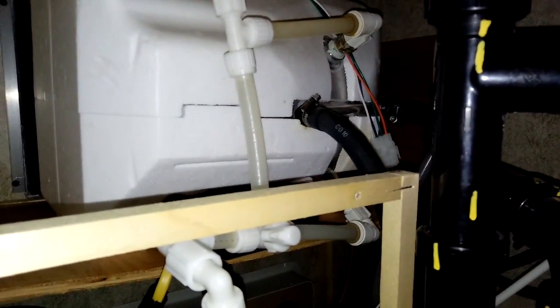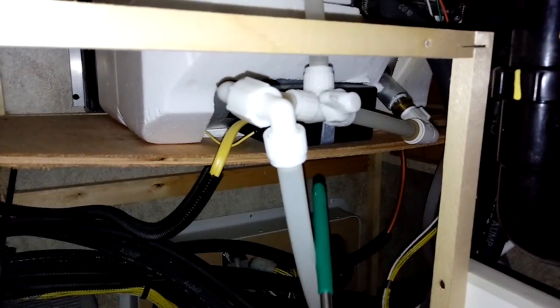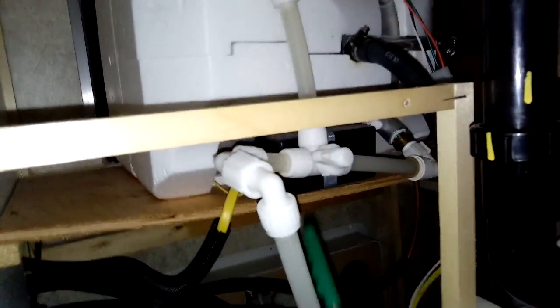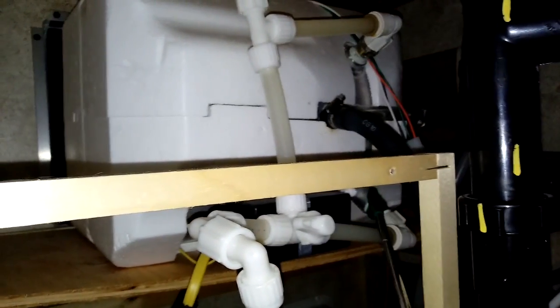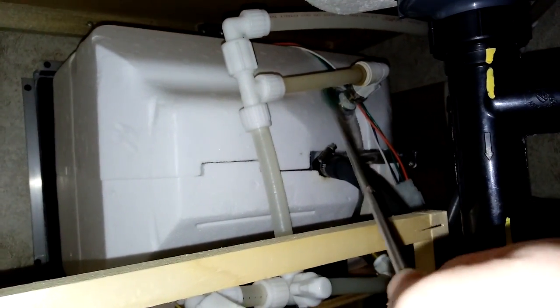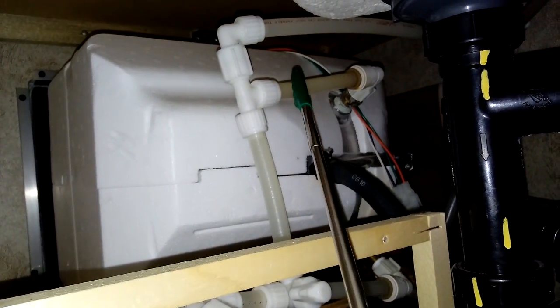I'm going to explore my hot water heater — I'm assuming it's on the inside where the plumbing is. I've gotten underneath my sink and that's where my hot water heater is located. Obviously rig-wise that might differ, but if you trace the lines, the water is coming in from this line. Another way to tell, especially if the water was hot previously, is to feel the lines — this one feels cold and this one up here feels warm. So I know that we're coming in to the water heater here, and that actually goes into that port right down here where the cold water enters. Once water gets hot it rises to the top, so your water heater pulls hot water from the top. This hose felt warm so I know it comes out there.